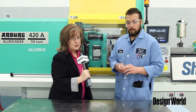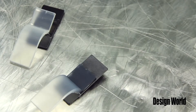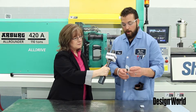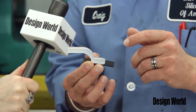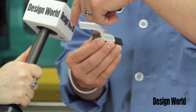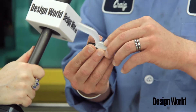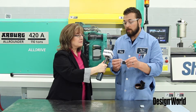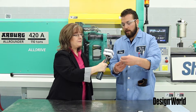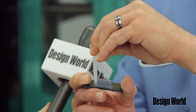And I see you have a few examples here of some of your testing. These are nylon plaques that we are over-molding onto, and as an R&D test fixture we're seeing some issues — some that are not bonding. What we're looking for is not an adhesive failure, but a cohesive failure, which could be the silicone breaking or the substrate breaking on our test fixture. What we're looking for when we run these is a very good bond to the substrate.